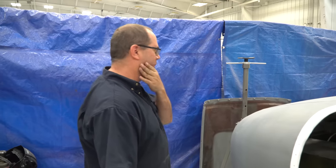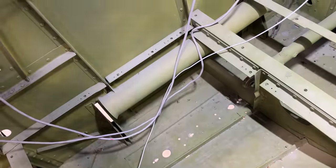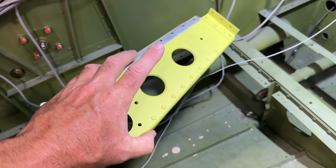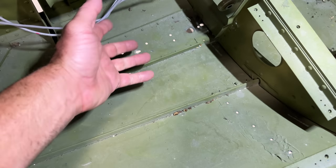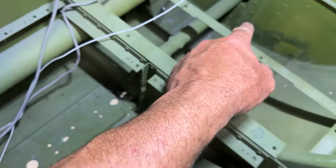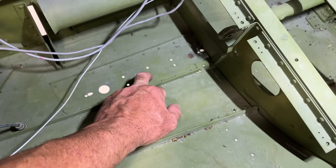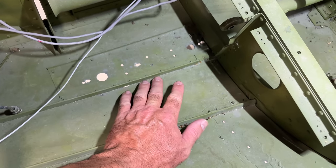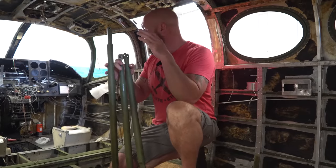It still seemed kind of slow when we flew out to Bluffton, but whatever. What we're going to do — I've seen this repair before — we're going to order a new piece of this stringer material, double the size, connecting up front. We're going to make a doubler that'll go on the base here plus one on the outside of this rib just to give it extra strength.